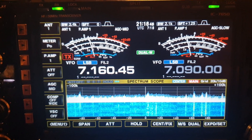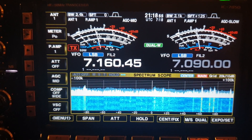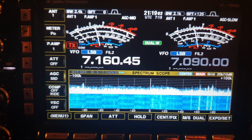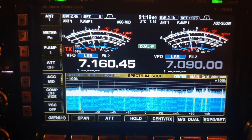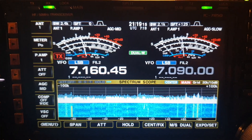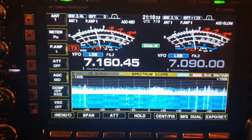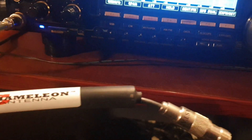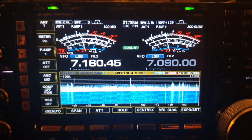Normally you get about a meter of coax and you just put two PL-259s and an SO-239 joiner on there. What we're going to try is putting one off the end of the tuner as well - really just to see if we can find out if there's a way to use these straight ferrites and how they vary in performance compared to the round ones. Obviously with the round ones, every time you bring that meter of coax around and turn it through, you're getting a little bit more attenuation. That's why I was a little concerned as to whether these chameleon ones would actually work. They're a great idea, but you're probably not getting as much benefit as the QRM kits that are available - just from my basic knowledge, and that is very basic by the way.